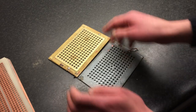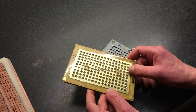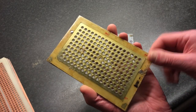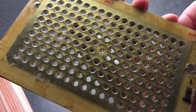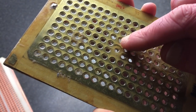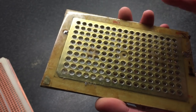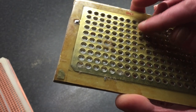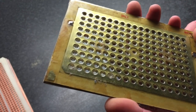These are the panels — this is one stator, this is a complete panel, and it had four of these. What they did: they used normal PCB, drilled a bunch of holes — quite a lot — and if you look close, you can see that the hole is actually smaller than the copper hole. That's really nice, because this PCB material is a good insulator. Because you don't have the copper on the edge of the hole, you can use higher bias, or higher step-up ratio — less prone to arcing, that's the reason, actually.